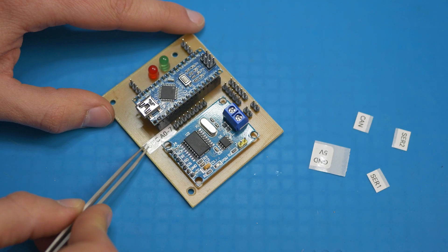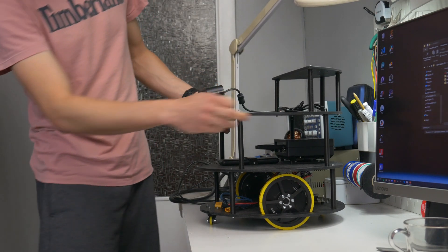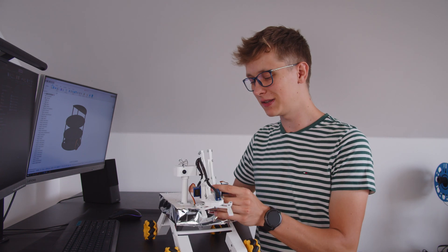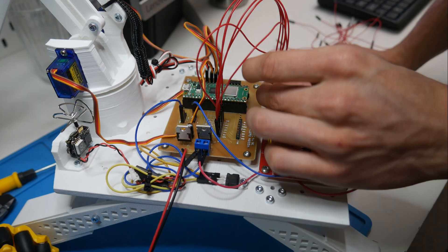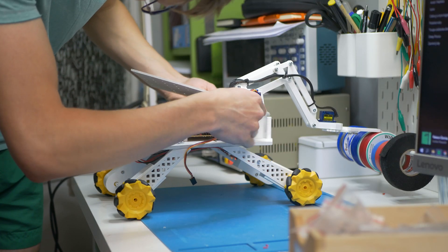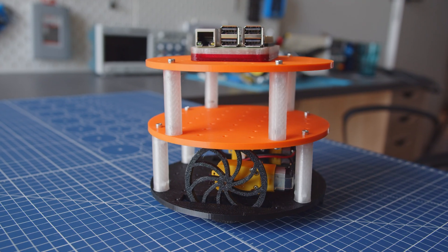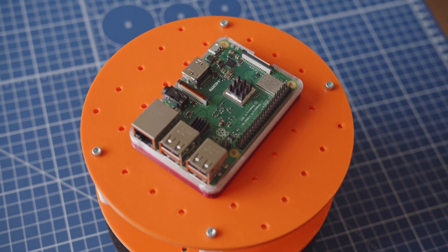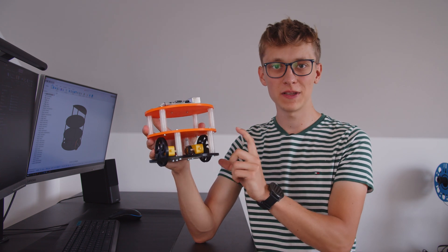The chassis was extended to something you can see right here — I added the depth camera and I'm also working on adding the LiDAR. There is a place for an Nvidia Jetson Nano, and the plan for the future is to add ROS to this robot and create some fun projects. Then there is the Mini Mars Rover, a project that I really liked. Unfortunately the arm is broken, but it is also compatible — you can easily attach it to the ORP plate, and so is the FPV camera mount. The custom PCB made for this project also has the proper holes with 20mm spacing, so you can attach it directly to the plate without any holder. And here is a still-unfinished very small chassis showing that ORP does not have to be really big — it is small and completely 3D printed: connectors, plates, holders, wheels and motor holders, everything.